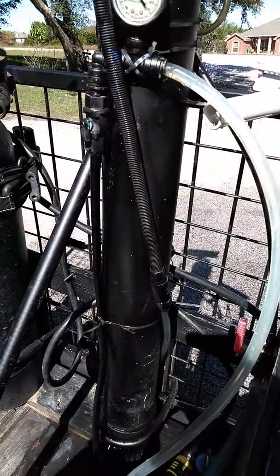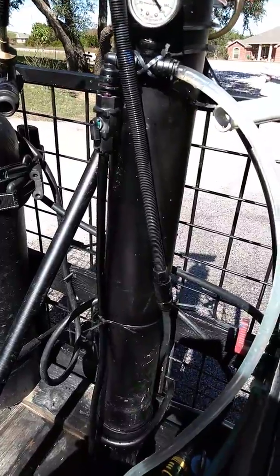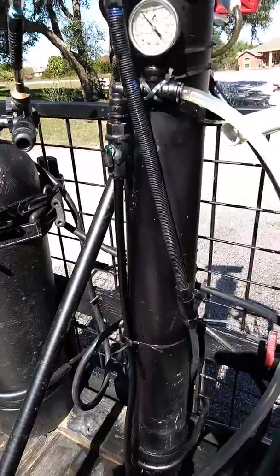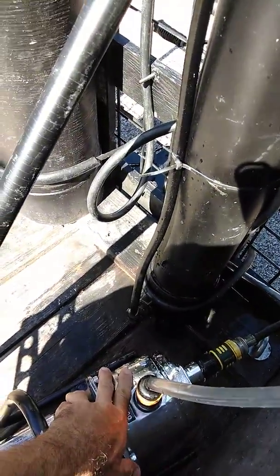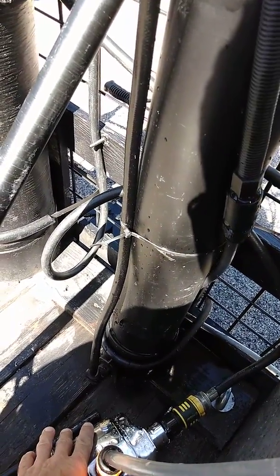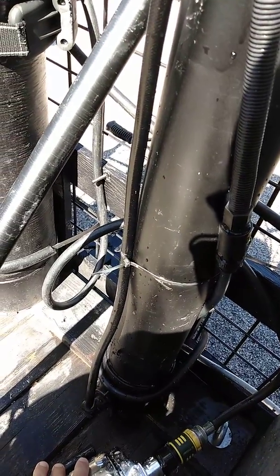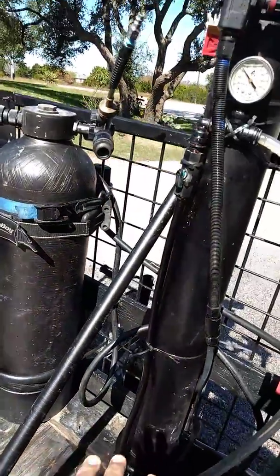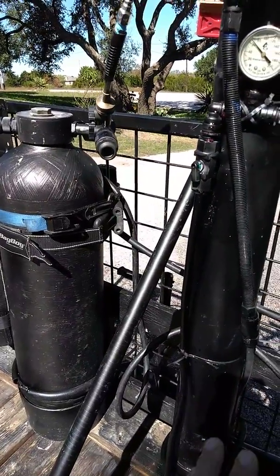If you're looking for a pump, try the Wayne. I like cheap too, but those transfer pumps you're seeing on some of these systems are total crap. Don't buy them — it's cast iron. Especially if you go after your pre-filters, you are just going to flush rust into your RO membrane. I had my membrane fail because of a rust bloom. It ruined it, even though it went through a separate filter after that — killed it. So don't do it, don't get a transfer pump.